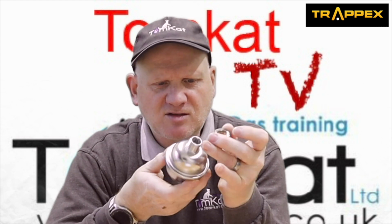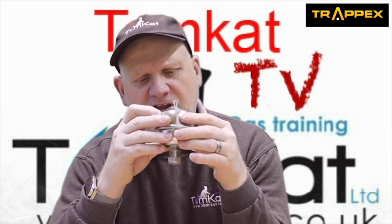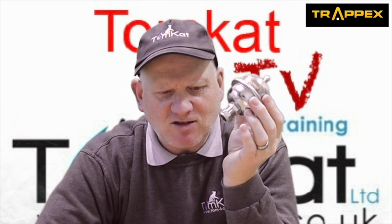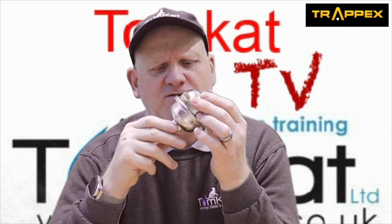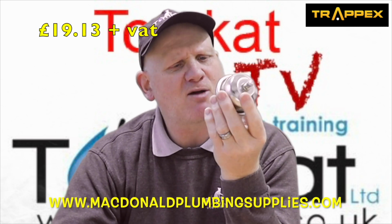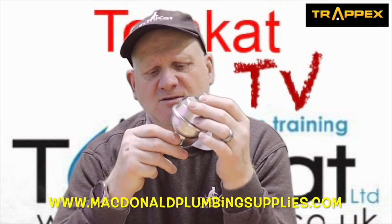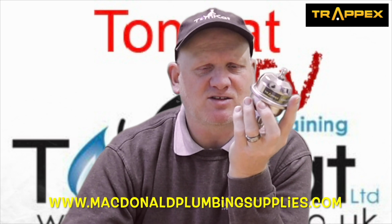So it's designed so the pipe can just slide in there, and your nut and olive goes on there, so it looks neater and you don't have a male iron to copper connector on there. Now, you can buy these, I believe, from McDonald's Plumbing Supplies for £19.13 plus VAT, which isn't that much really, is it? 20 quid for an expansion vessel. So that is the centra shock vessel.